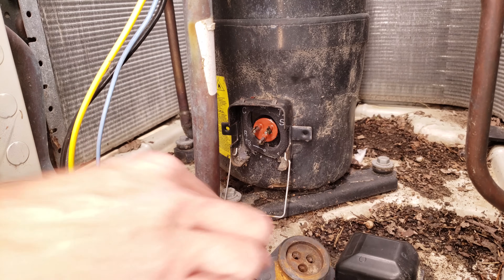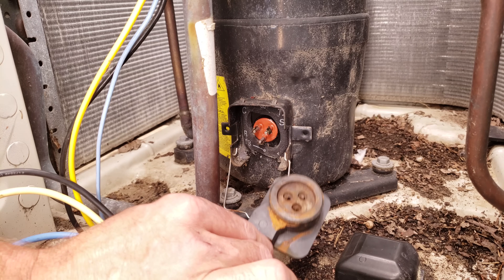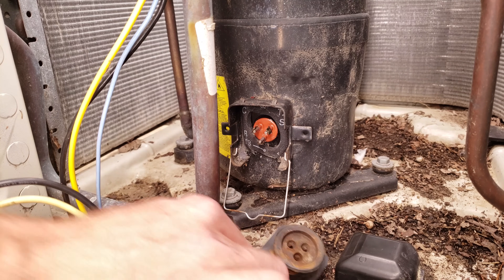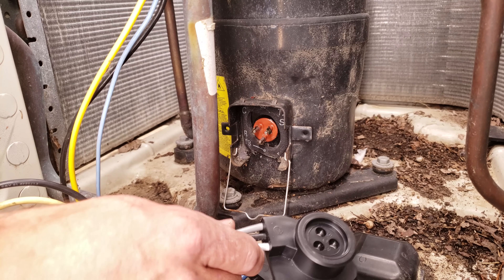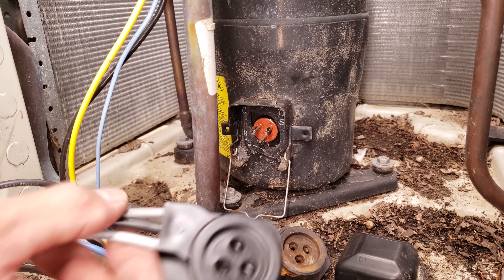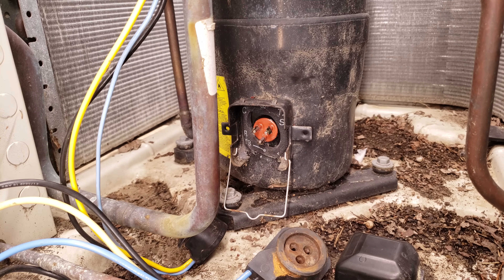You want to do a good job diagnosing your compressor. Make sure it's not just a problem with the plug or a loose connection. You can always replace the plug assembly with a new one — it's the same size and seals up well. Make sure you do thorough diagnosis before condemning the compressor, and now let's look at a scroll compressor that is actually shorted to ground.